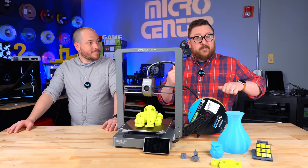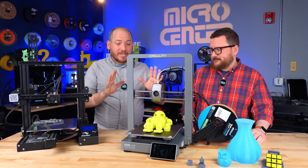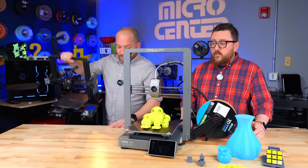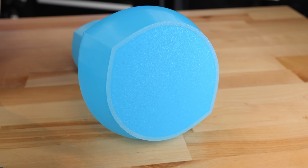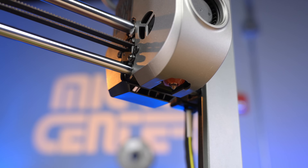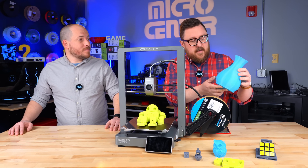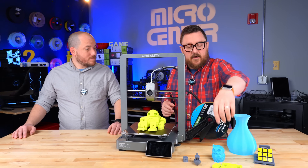We've had this printer for a little while and we've been printing. If when you think of Creality you think of the original Ender 3 Pro, this machine is miles ahead. The V-rollers on the original Ender 3 Pro are fantastic for budget builds, but these linear rods are incredible for high speed printing. We've done a couple of different prints - one being this vase here. What I was impressed with was the first layer was just absolutely perfect. It's even hard to discern which way the head was moving, thanks to the PEI sheet and the extrusion consistency.